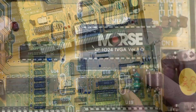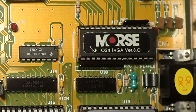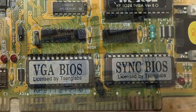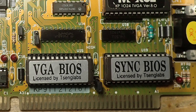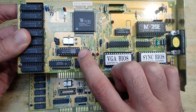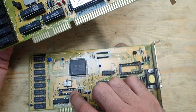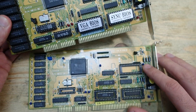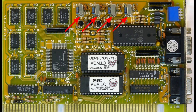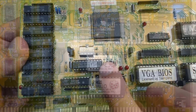This IC here has a sticker, but I know from experience it is a RAMDAC. This IC is responsible for conversion of the digital video signal into an analog VGA signal. These two chips are BIOS and sync as I already mentioned. I think I can just copy those two EPROMs on the EPROM programmer. And then there is this ICS 2494N IC — this one is a bit hard to find, but it is responsible for clock generation needed for the different resolutions and output formats.